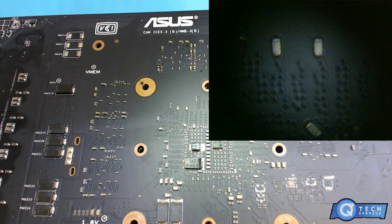I mean, you get people down, you need a reflow, or you need to do an actual CPU reball. They would go quick the first time with the thermal paste being bad before it needed a reball, but once you did it once, you probably had six months, and then you were going to red ring again and need a reflow.